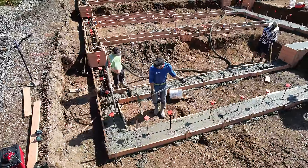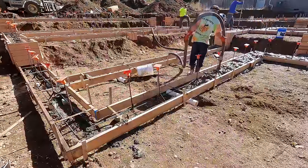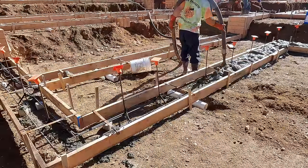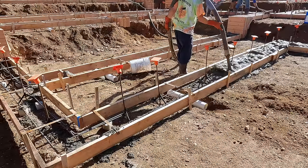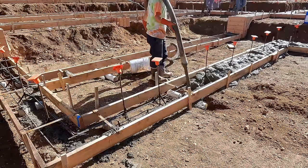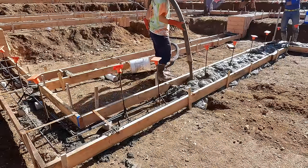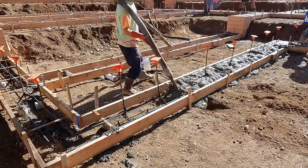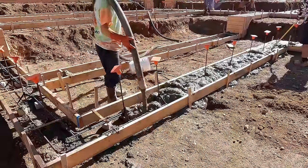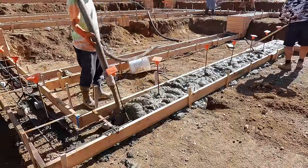Notice Kyle's dialing it in — I get it reasonably close and it is always the right amount of concrete. Here's a real-time clip of the same section of footing. Watch how Ryan handles the hose as I come through and level off the top of the concrete, push it against the forms and kind of pack it. Then you'll see Kyle come through and dial it right in so that Brian and Greg running the mag floats can just polish the top enough to snap lines and set clips.